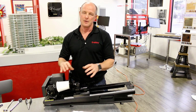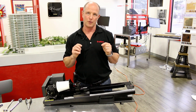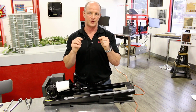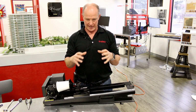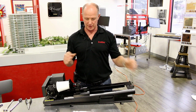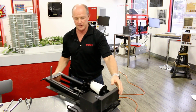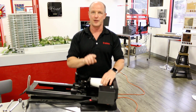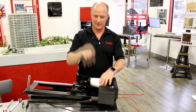Okay. Remember on a rotary attachment that the rotation on any systems I've ever worked on is always towards the back of the machine. So once it's plugged in and you're looking at the actual rotary attachment in the front, if I spun this around like this, the turn is towards the back of the machine so that the mug goes back that way.